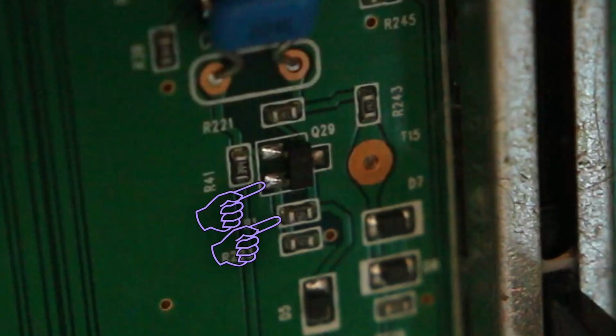Great. I wanted to add a switch between that leg of the transistor and that one pad of the resistor. So in theory, the connection we just broke, if there's a switch on the back of the Odyssey, you can flick it on, and now that connection is made again. And so you have this extra synthesis option. You're not just modifying this.